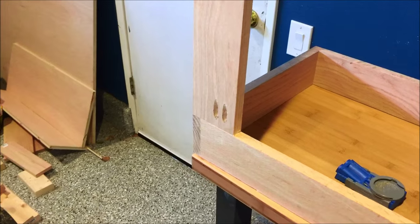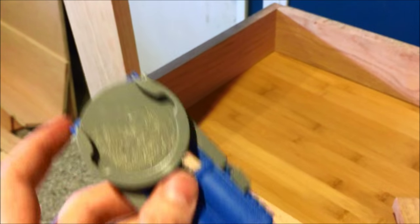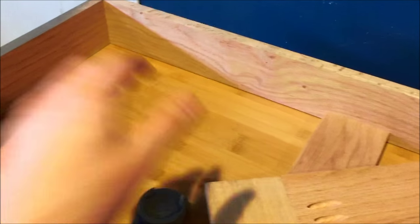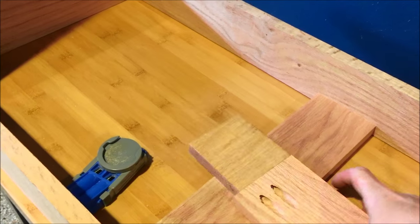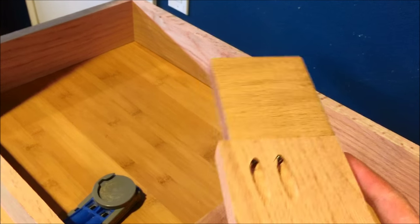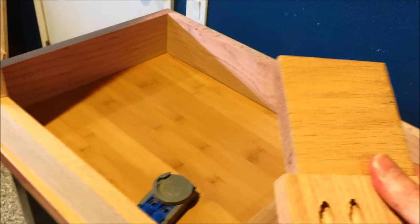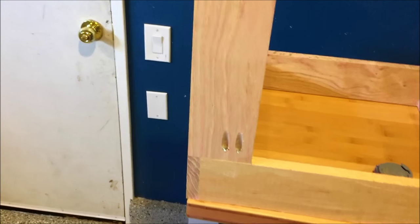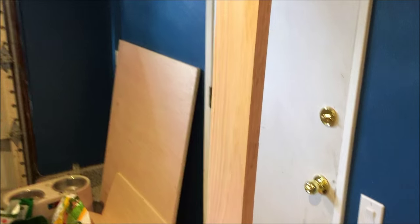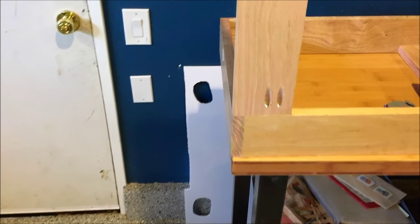Now you can start seeing the legs being mounted to the base of the stand. I'm using pocket holes — I have this Kreg pocket hole jig system that works fantastic for this kind of thing. If you want to do something like this at home, there are more in-depth videos out there, but before your first one, make sure you do a test depth on some scrap wood to test how lock-tight the joint is. These are really tight joints once secured, so I feel very comfortable that this frame will be very secure.